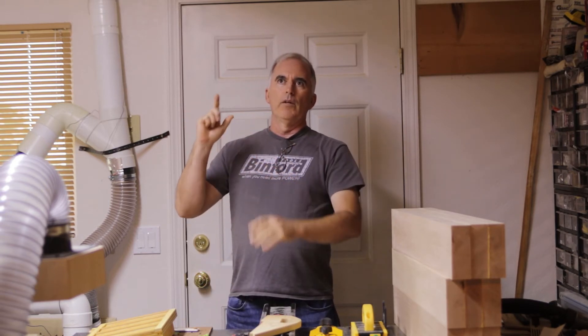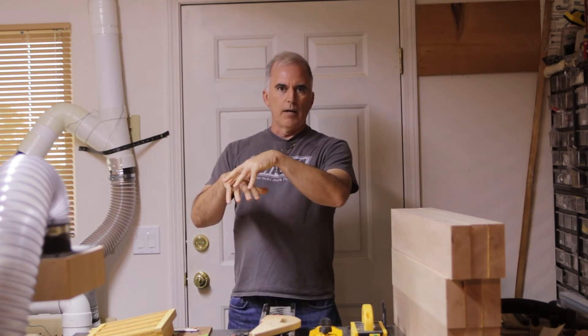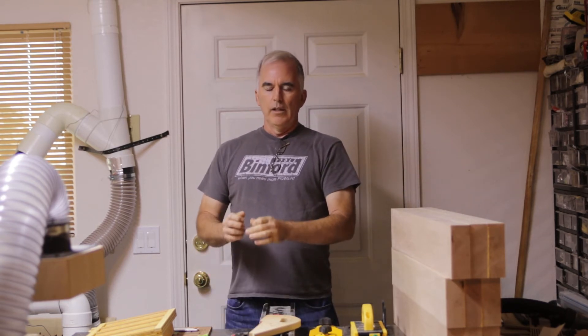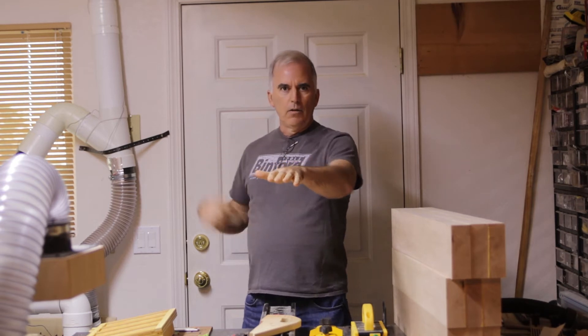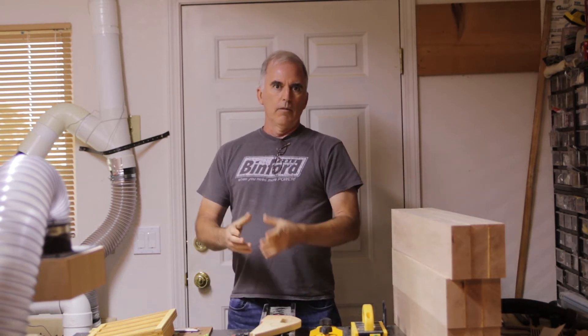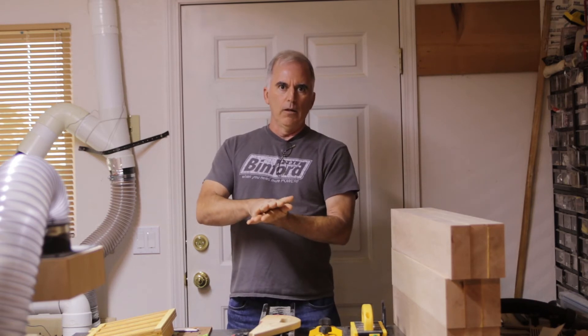So I took them apart because I didn't glue the bigger runs — in case there was a clog I could take them apart. On the long 10-foot sections I put a towel in there with some heavy lead shot on the top and just pushed it through, tilted it up and ran it through, and cleaned all the dust out of the inside of the pipe. Then once I put the tape in there, I used a string to peel off the backing out of the whole 10-foot with one end connected, so the tape itself didn't move. Then I did the same thing with the lead shot bag and ran it through several times to help push the tape down onto the PVC pipe.